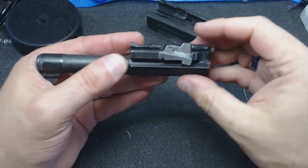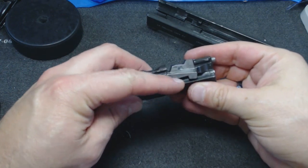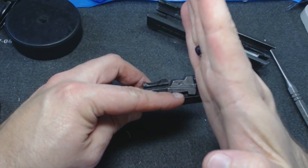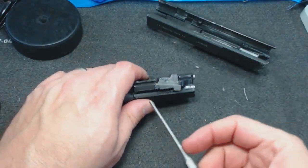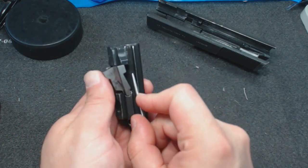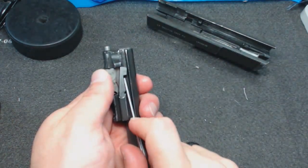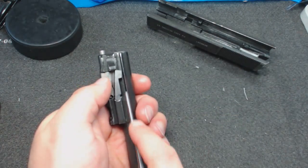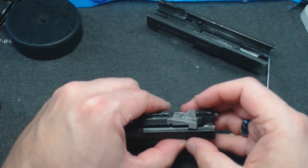That's a good positive lock mechanism. If you actually look, that's not a 90-degree angle — it's actually coming in some. So the harder something pushes on this, if it were angled perfectly neutral it would still be safe. If angled a little positive, that pressure could actually lift it up. But it actually comes down and is cammed in just a little bit. So the harder you push straight back on this, the more it's going to keep itself in that down locked position. Something has to intercept it back there to actually kick it off.